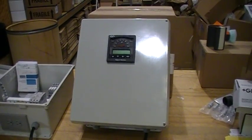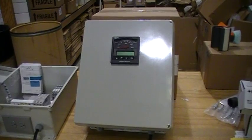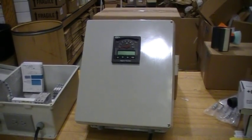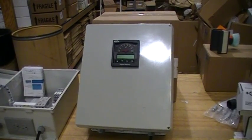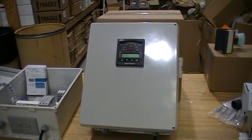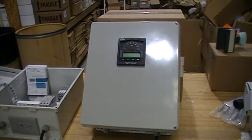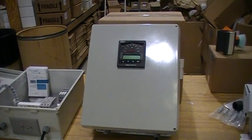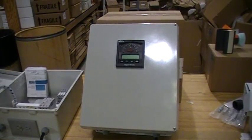This panel will be installed next to a 750 gallon equalization tank that collects washed down wastewater within the plant. This wastewater then overflows to a similar size treatment tank which contains the pH probe and preamplifier. The reading from this probe is used to determine whether we activate a pump feeding acid to the system or one feeding caustic. Once at a neutral pH, the wastewater can then overflow to the sanitary sewer system.